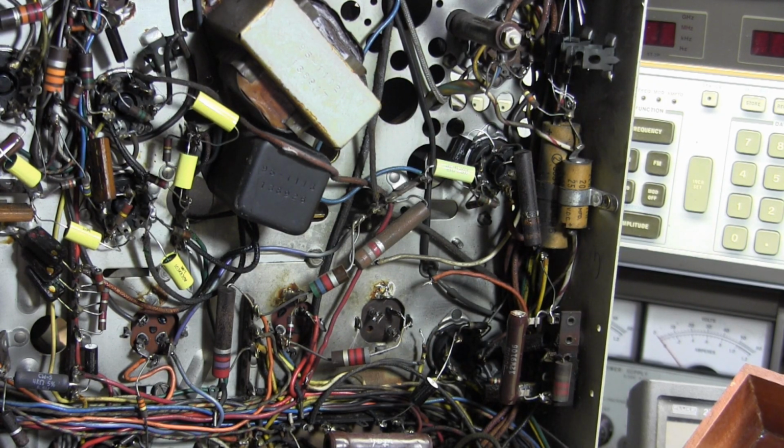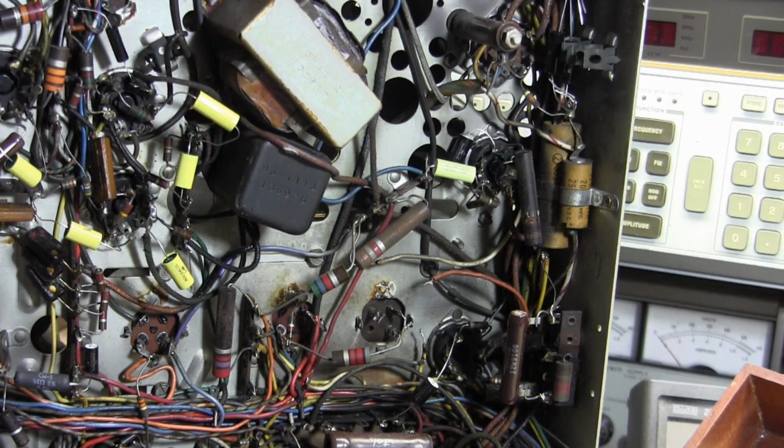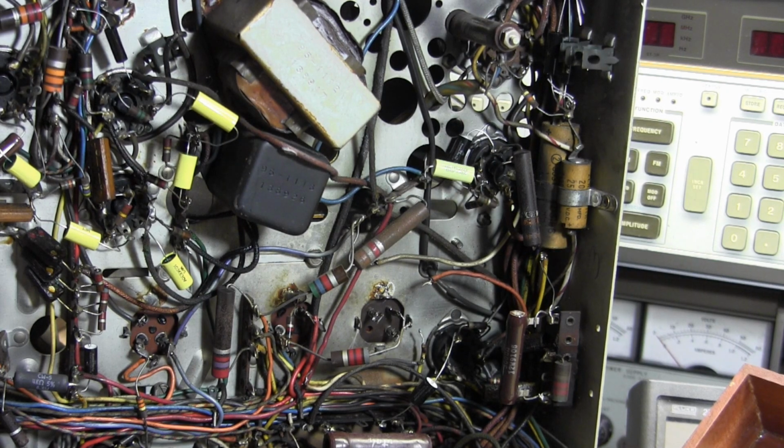Internal resistance. Resistance times current equals heat. So when you've got a lot of ripple current in a cap and it's building up internal resistance, it's going to generate internal heat, which will just cause a runaway effect eventually, where the heating will cause the capacitor to degrade, which will make the internal resistance go up higher, which will make it get hotter, and so on until it vents.